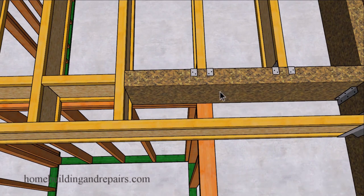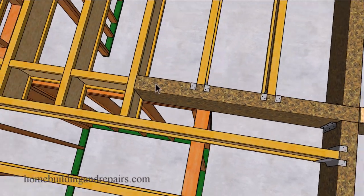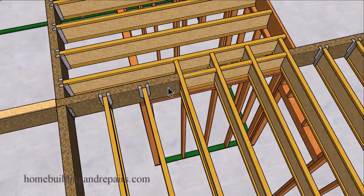The plywood switches directions because the joists are switching directions. You might want to extend the beam if you have a little extra to spare. If not, you can stop the beam where your lumber section ends — I've been doing it for years. There's no need to order longer lumber; just run it past a little bit to get more bearing on the walls. You can see where I'd have a difficult time attaching the hanger if I stopped it even with the edge of the wall.